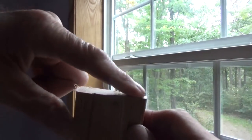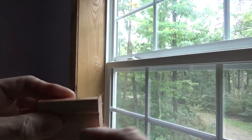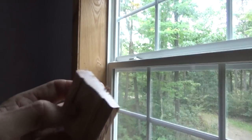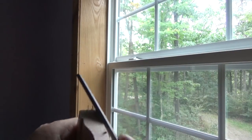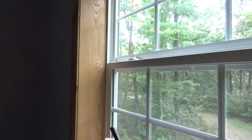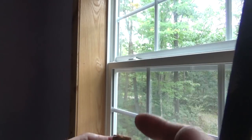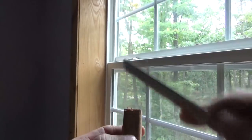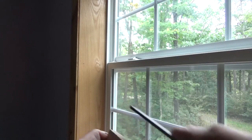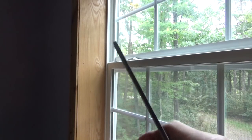Yeah. This piece of molding on this edge was cut with the molding laying flat in the miter saw. Okay? So you can see there's burrs on the top, there's burrs on the back. Now the ones on the back don't really matter, because I'm just going to file the edge of that back and knock them off of there, and that'll be fine. But when you're taking the burrs off the top, if you file this direction towards me, you're going to pull them strings off this. So what you want to do is run your finger over the top of that first of all, and then file that direction. What that does is gives you a nice straight finish line there without any mistakes on it or any fiber tears.